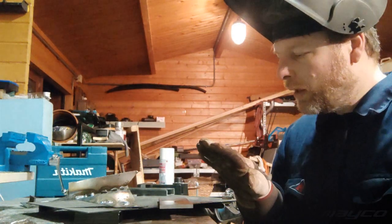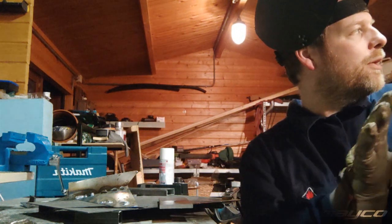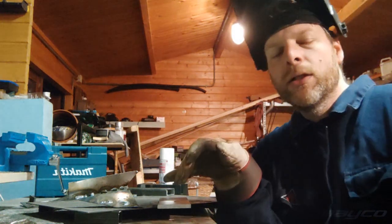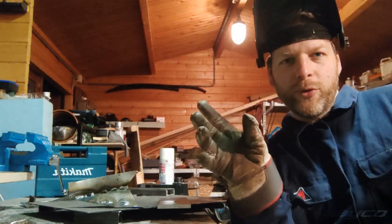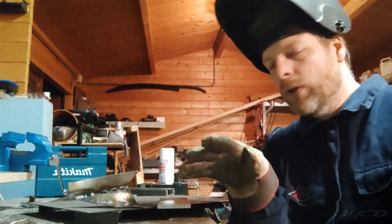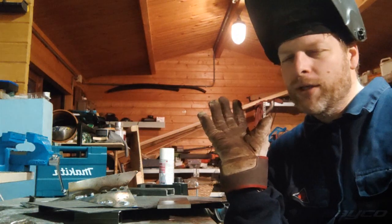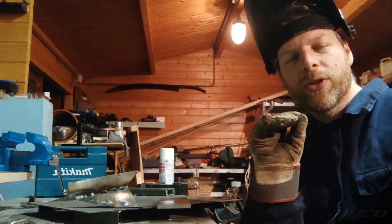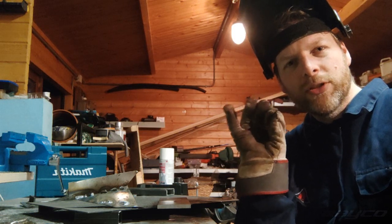So I grabbed a little bit thicker material, and now that I have a little bit of feeling for the settings, what I'm trying to do is go for the little bit thicker material. The setup that I have now is 24 volts, 160 amps. Now going up in voltage means also that you go, I'm doubting if it's 21 or 26 volts, but then you go into a different area of welding, basically, and you can see and you can hear it.